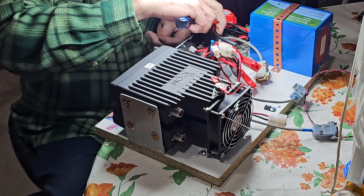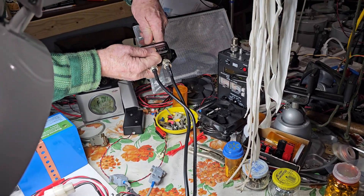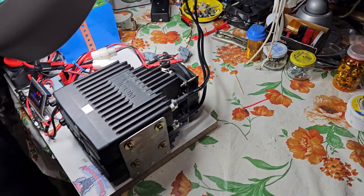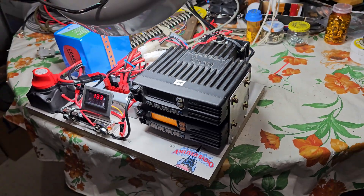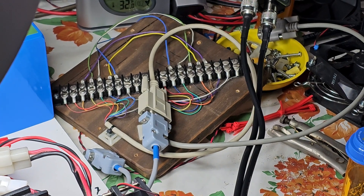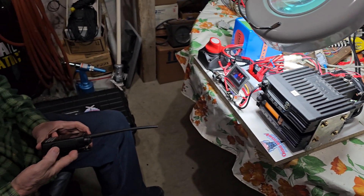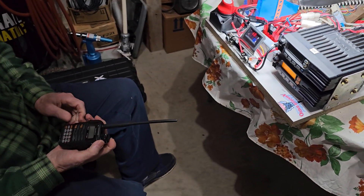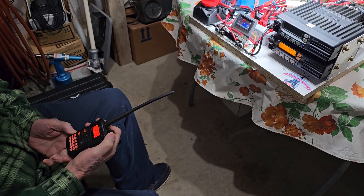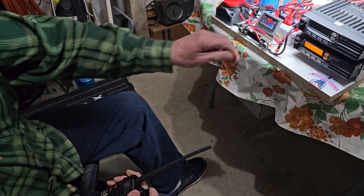Many of you have seen the repeater series we've been doing here. Just as a review: we have a 15-amp lithium-ion battery, a master power switch, a purpose-built voltmeter amp meter with a shunt that we created from parts we purchased, the two radios with displays, and a distribution box just behind the voltage amperage display in the middle. Our logos are on the board that we mounted everything to. Now Don is going to do some testing.